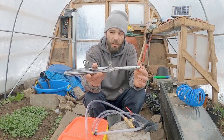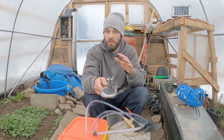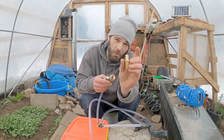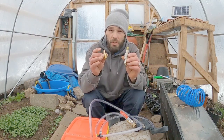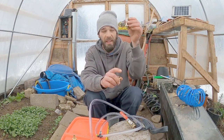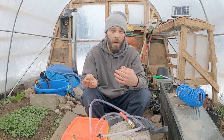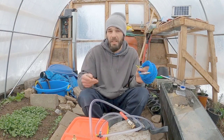This is where we will connect to our burning apparatus. I've got a free little grill lighter and I may be able to use the electric start on it with a small battery. This will eventually be what I burn on when I have my large system set up, which I plan on using my rain barrel for. We're using these little barbed nipples to connect our hoses. This quick-release fitting for an air hose — if I figure out a way to hook this up at the top of my large biodigester, I'll be able to have a quick-release siphon for the methane, allowing me to hook in and unhook, running lines as an interchangeable system.